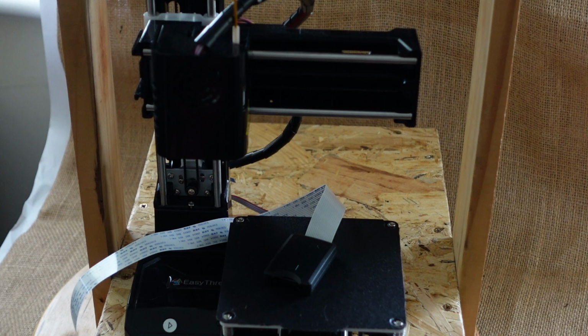You don't have to use the self-leveling, and then other issues come into play as well, such as the cleanliness of the print head. Because of course, if you go trying to tram the bed and the print head isn't clean, then that's another issue that people don't seem to mention very often. That you do need to clean the print head before you go leveling the printer, which is something which I'll go on to discuss possibly.